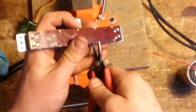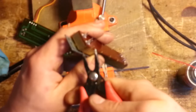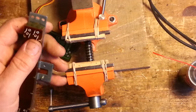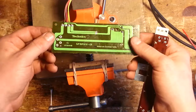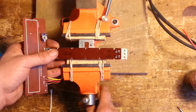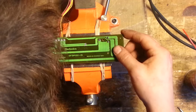Sometimes I've seen people hit or mash the fader and it blows the whole back shell off — but you'd be surprised how much abuse these things can take and still be reassembled and work just fine. A lot of these MK2s that I work on are from the 80s, so they're at least 32 years old. So now we're going to put this all back together — clamping this back in the vise and reinserting the board back on here. Just give it a gentle press; you don't want to mash the pins or bend one over, so take your time and work slow.